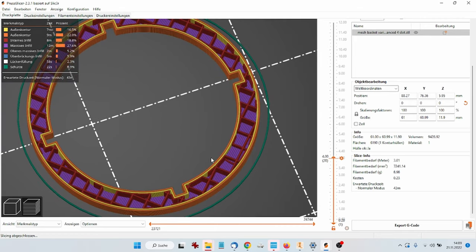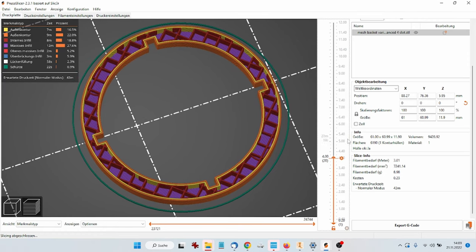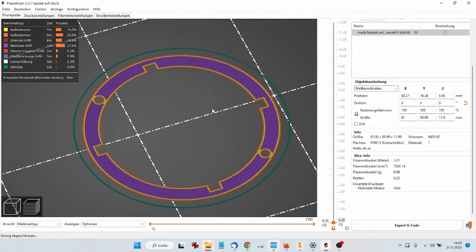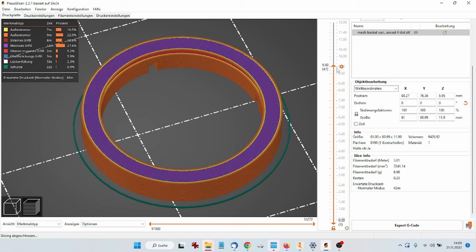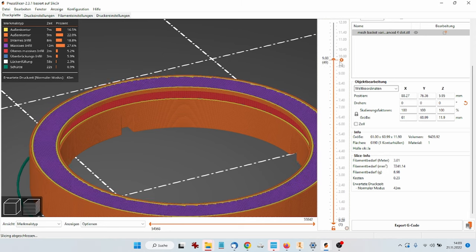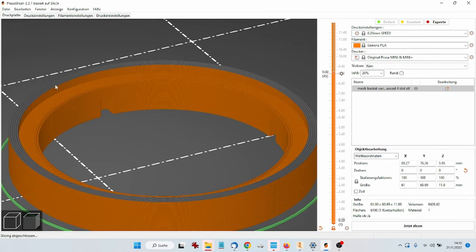The infill on this model is only around 20%, but obviously if you're putting it into a submersible rotating jar you'd want to bring it up to 100%. I don't think it'll have a huge impact on the material, maybe a bit on the structural integrity. Regarding the metal wafer: during the print you'll have to put a pause right when the wall is at its highest, so you can stop the print, place the wafer in, and then print over it. It is a bit risky and you have to watch carefully, but I really didn't have any major issues.